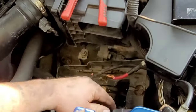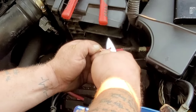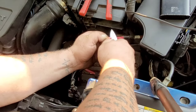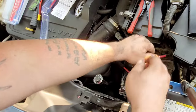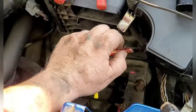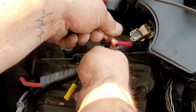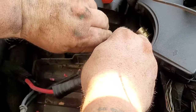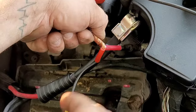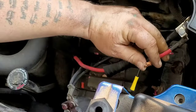We've already cut it, but that would have been if it fit into the splice connector - it didn't, so now we have to cut this back a little more because we're going to be splicing this together with the positive cable. I'm showing you how to splice them together: we're making an X with them and simply overlapping each other, nice and tight. You're going to keep doing that - one turn, hold it, another turn - keep turning until it's nice and tight and there's no way to turn it anymore. Once you do that, you're going to bend it back on itself.